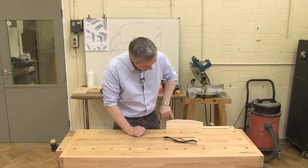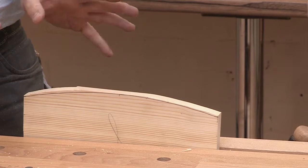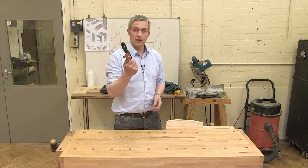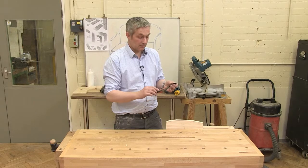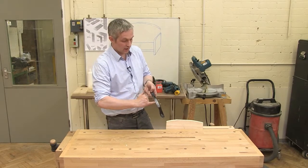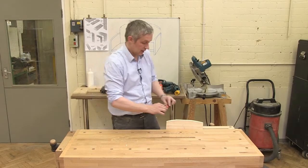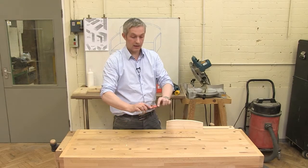With our jigsaw we've got quite a rough line that certainly wouldn't be good enough for finished high-quality woodwork. We have to take the workpiece down to the line, and we're going to do it with a spoke shave. A really good hand tool for finishing off any sort of curved work, it looks like this. We'll look at how to sharpen them, but for now we'll imagine it's set for a very fine cut. This one has a flat bed — there are also ones with very curved beds for tight inside concave curves. This flat-bed version is for convex curves.